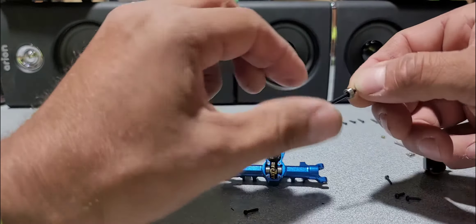Take your other gear out like that, then your bearings — slide those in. Take your gear and slide it in between them and there you go. Now you can take your actual shafts and slide them in. You may have to twist them a little bit to get them to slide into that brass gear in there.